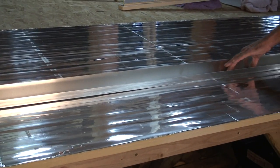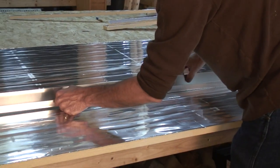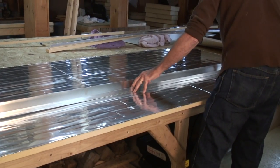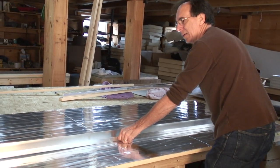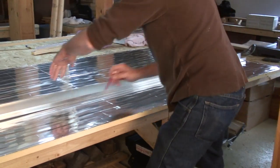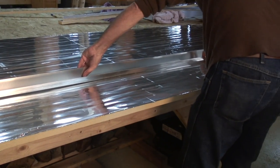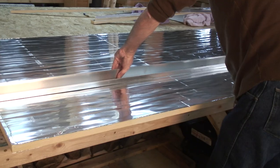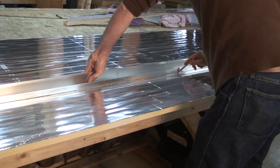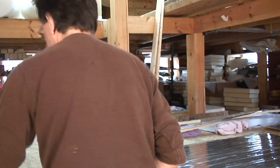there's a little bit. I'm amazed from my life of selling foam insulation for years. How many people ask, how do you cut foam insulation? And we'll show you. First, the beauty of this foil is that it's real easy to mark it. If I don't move my straight edge too much, we're okay. And if you stay against the straight edge when you make the mark, the chances of making a straight line are greatly enhanced.